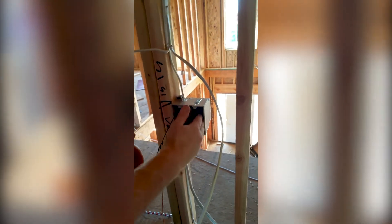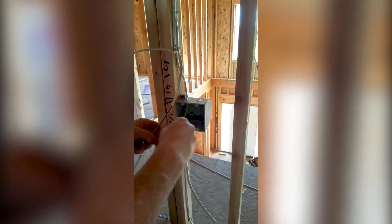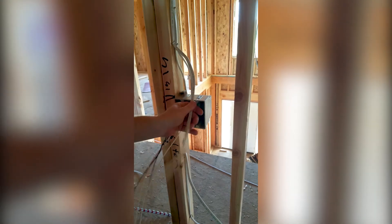This is your fan — put it in the box. Fan is your second switch: two loops identifies that it goes in the second slot. This is your vanity — strip it a quarter to half an inch below the top of the box. One loop identifies it goes in the first slot. This is a feed.